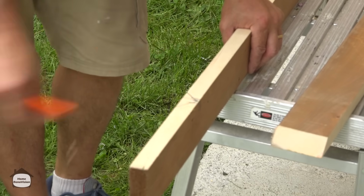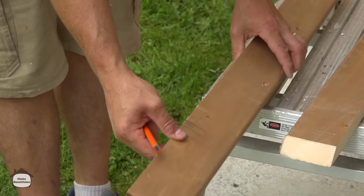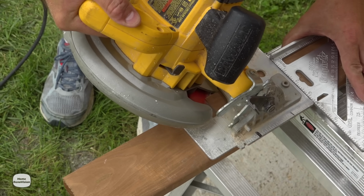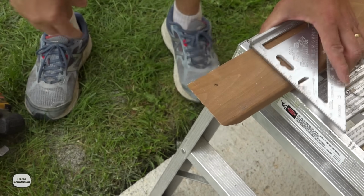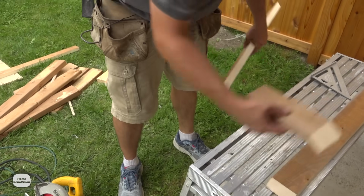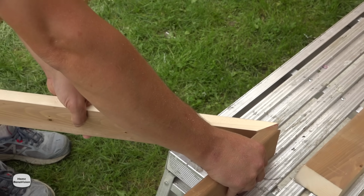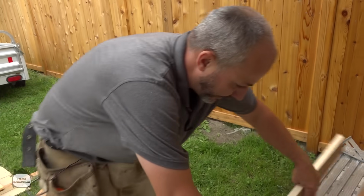Because we don't get the door open enough for comfortably getting the lawnmower in and out by going tight, we're going to remove almost 1 inch from the dimension of this wood. Also, I'm going to change the angle to full 55 degrees. So if you can imagine the last piece here, if it's this far apart, when you open the door, it'll swing to this far open before it makes contact, which is perfect. That is a ton of space.